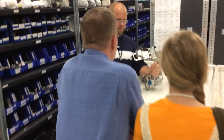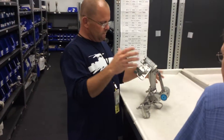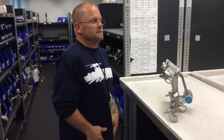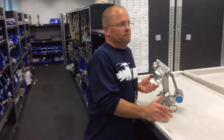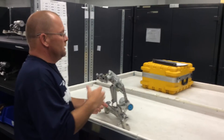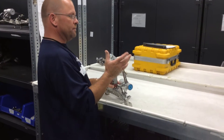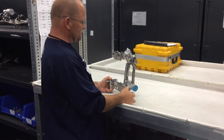If you haven't seen any of the video in the water — when you're encapsulated, there are things you can see and things you can't see. Down here we can't see, so it's all done by feel. If we're going to perform any kind of maintenance, wearing a tool belt, we can just look down and grab our tools. In the suit, you have a limited viewing area, so we want to have all the tools out in front. This is basically our tool belt — it's called a modular mini workstation.